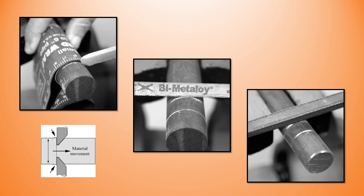I'm going to come in a little from the end of the bar and mark off a 9/16th of an inch gap for the half-inch collar. Why 9/16th? Due to the offset fullers having more surface area on one side of the fuller than the other, the collar material is going to get compressed as the bar moves between the fullers, resulting in a narrower but larger diameter collar material.